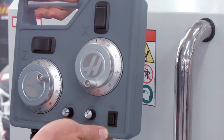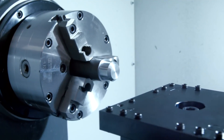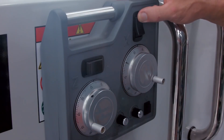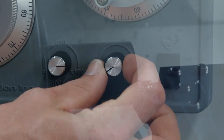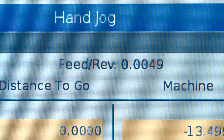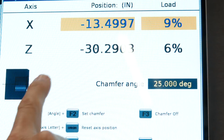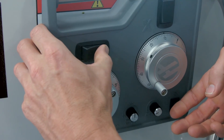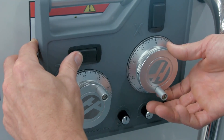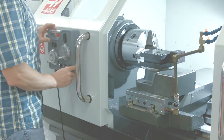And check out these e-hand wheels. The magnetic back keeps the unit stuck right where you want it. Use the Z and X hand wheels for positioning and manual cutting, and the jog buttons for rapid positioning as well as precision feed cuts, where you can adjust feed per rev on the fly, right there beside the hand wheels. We've updated jog chamfer, and you'll be glad we did when you need to cut angles. Enter the angle you want and chamfer in either direction using the jog button. Need to go deeper? Adjust position with the hand wheels and make another pass. This unit is easy to use and becomes familiar fast.